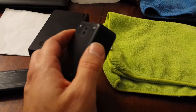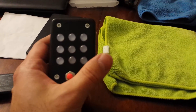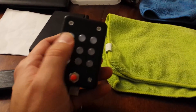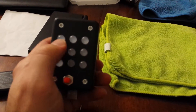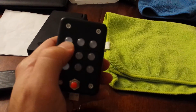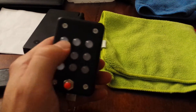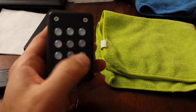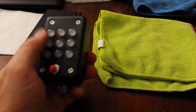I actually had mine lying in my junk box. And an RGB LED — well, those who play with Arduinos probably have a few of these lying around. You can pick three different LEDs: one red, one green, and one blue — that's totally up to you. In my case, I used a single addressable LED; they have a little chip in there — I think it's 2811 or something like that — which is a constant current, one wire data in and one wire data out that you can use to control a bunch of LEDs. So I've got 10 LEDs in there: one for sensing and nine for the display.